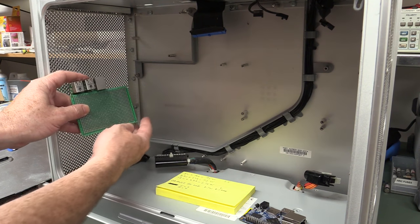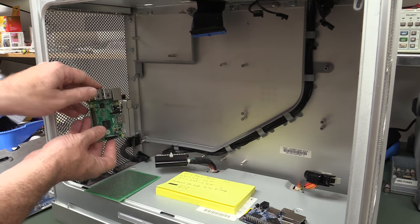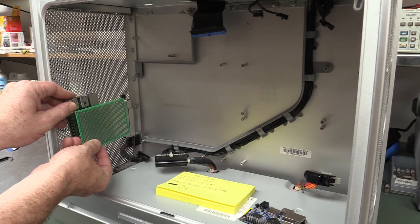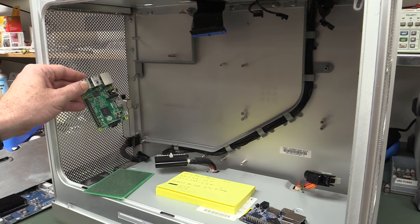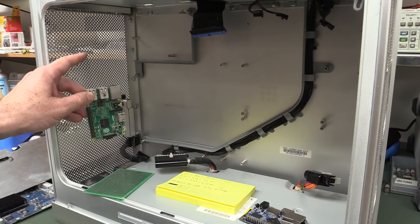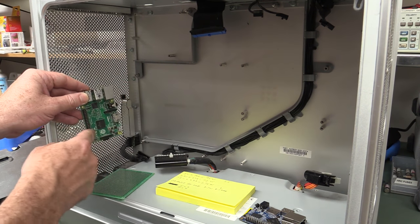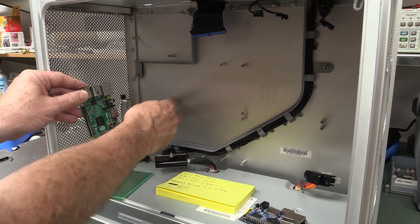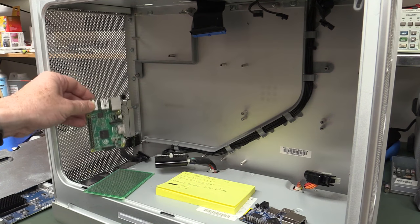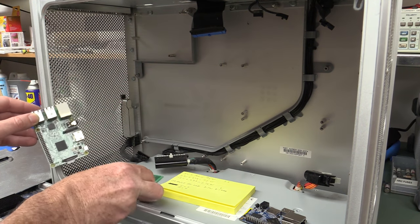And of course, you can supply your 5 volts power through the Raspberry Pi header from your riser board like this. But you could actually have two of them which then plugged in like that. But then you'd maybe have to change the pin out over here. Couldn't use the standard Raspberry Pi one, or you wouldn't have to wire them all the way through if you wanted to get, say, the serial and other ports out of their SPI and everything else out of these things. So you might have to have a custom header, a custom pin out on your riser board like that.